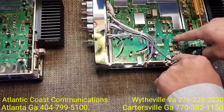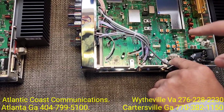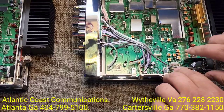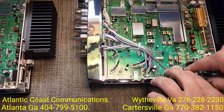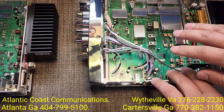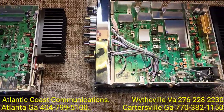You see these control pots here? Here we're going to set your modulation limits, your dead keys, all that sort of thing for the AM, the FM, the upper and lower sideband. You've got your high dead keys in this area, your low dead keys over on this side. All of that is right here and readily available and accessible to the technician inside the Gen 1 radio.